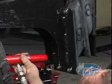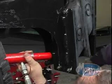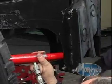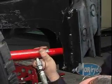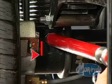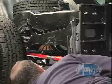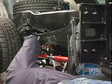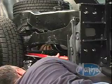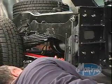Another way to relax the rubber shear spring is by using a port-a-power. If using a port-a-power, position it between the lower portion of the spring carrier approximately 2-1/2 inches from the bottom and the rear of the axle seat. Pump the port-a-power so that the pressure is removed from the spacer sleeve or pad, and remove the 1/2 inch nut, bolt, and spacer sleeve or pad. Then remove the port-a-power.